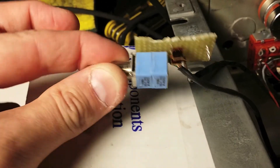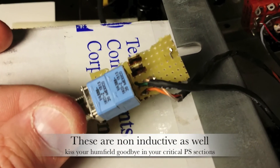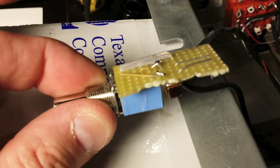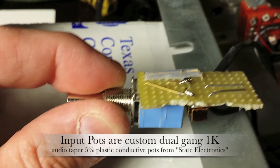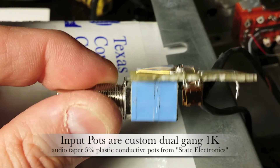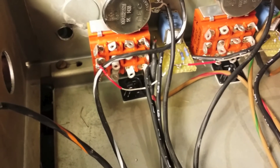There we go — we've got two of these bad boys on there. They look really cool too. This little tab is where the two resistors tie to ground, coming off the counterclockwise legs of the pot. The two counterclockwise legs go to the resistors, and the resistors tie to ground. Got my ground wire sorted out. One down — I've got to get some more of these done.